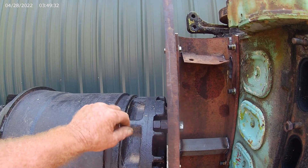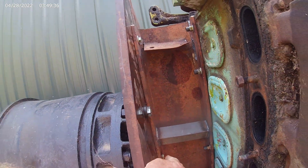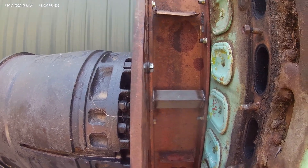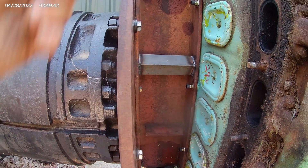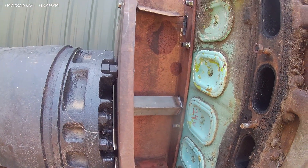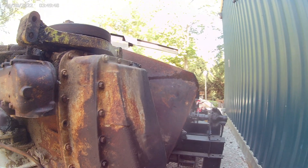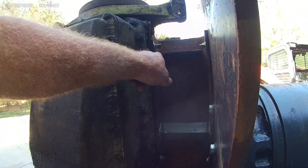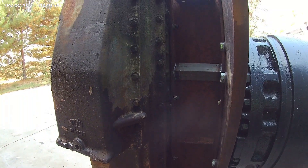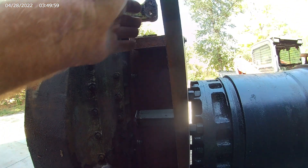You can see where it bolts — we ran a bolt all the way through here, then drilled and threaded the center ones and ran a bolt all the way through the bottom. So you've got five on this side of the block, I put a stiffener in the bottom, and five on this side, so there are ten bolts bolting that block, all bolted to this one-inch piece of plate.